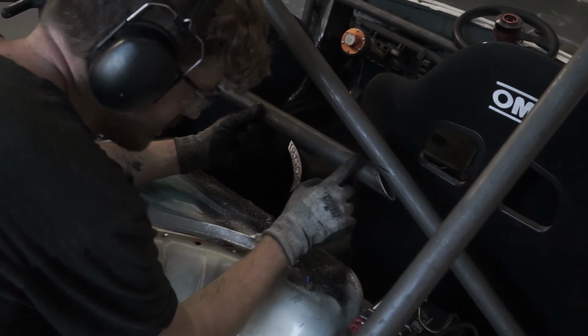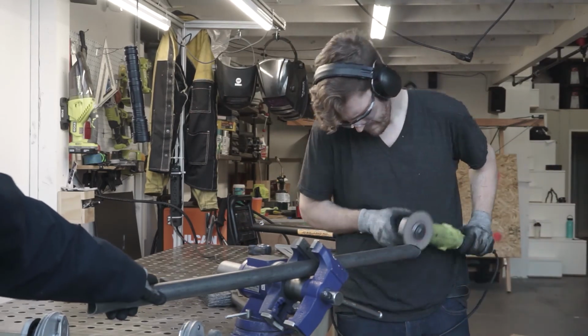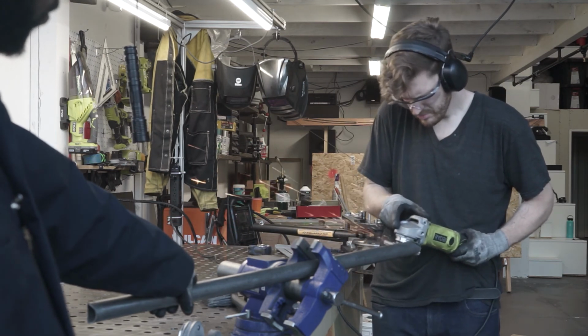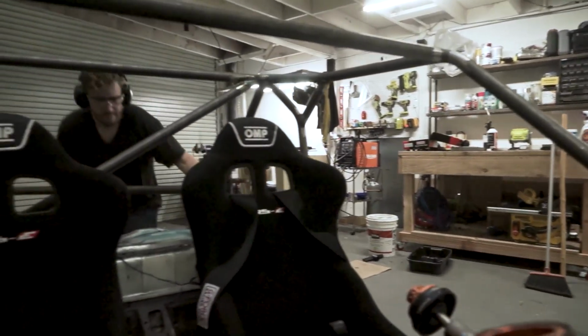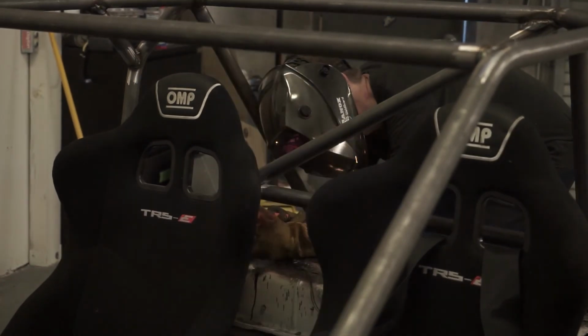So now all I have to do is keep trimming a little bit, trimming a little bit, keep bringing that part down, and this will automatically work its way up. So, yeah. This part is about patience. It's way easier to do like 10 rounds of trimming and refitting than it is to recut the pipe and start from scratch. So take a little bit off, test it, take a little bit off, test it, take a little bit off. It takes forever and it's super boring to watch, but it's kind of the only way you can do it.